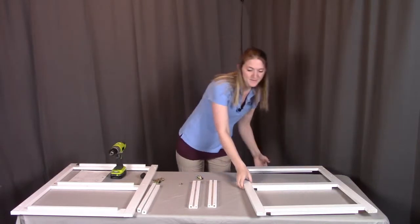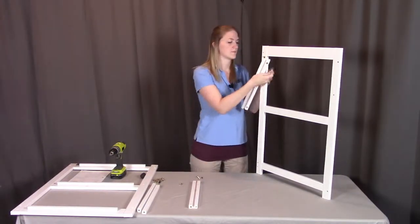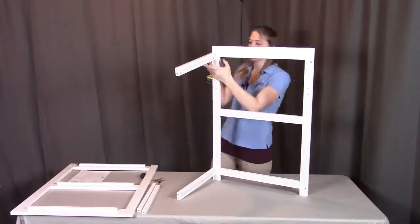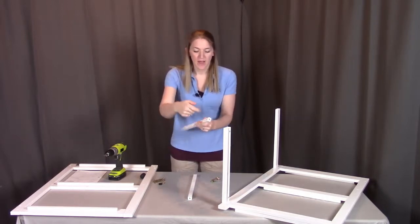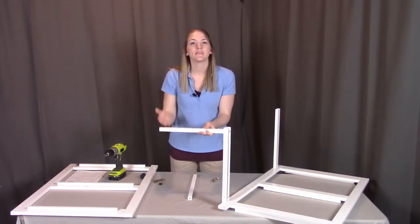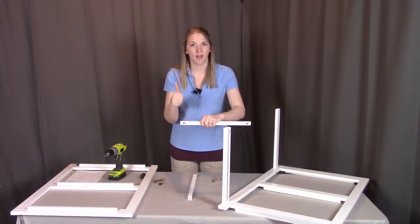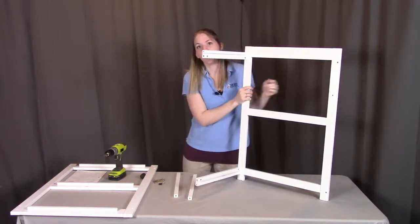So let's get these front two rails into place. Next, we're going to be putting on the rear rails. When looking at these rails, you'll see again the hole meant for the barrel nut, and then just one hole where a bolt goes through to securely hold it through that barrel nut. When looking at this rear rail, you're also going to notice some metal inserts. These need to be facing upward. So when putting these on, we'll have the barrel nut, the bolt going through, and that metal insert facing upward, one at the top and one at the bottom.